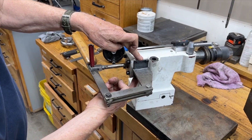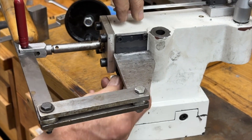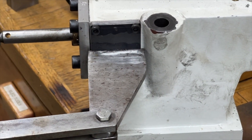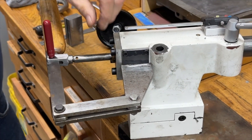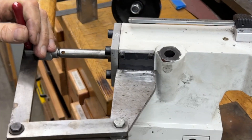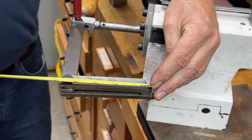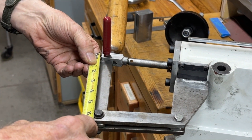The first thing you have to do is make a plate that fits on your tailstock that you can bolt this to. I put it on with four bolts tapped into it, and it has a slot to hold everything. It's bolted in place. This piece is roughly one and three-quarters by two and a quarter — all quarter inch plate. The distance out is four inches, so this dimension is four and a quarter and this dimension is six.